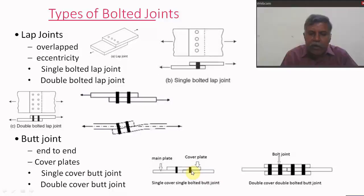When using two cover plates (top and bottom) with two bolt lines, this is called a double cover double bolted butt joint. In this case the CG will coincide, so comparatively the butt joint will provide good strength.